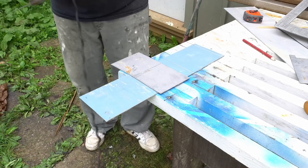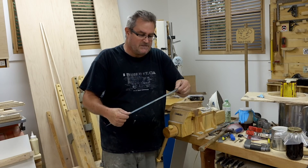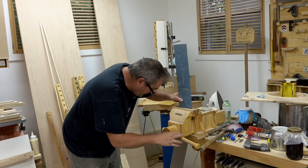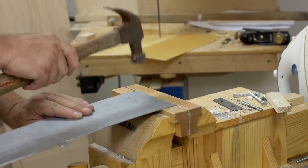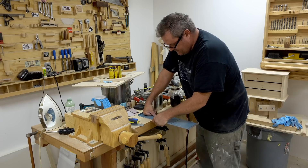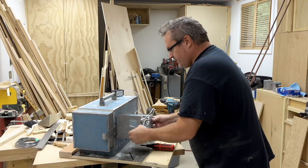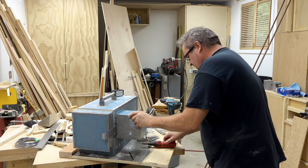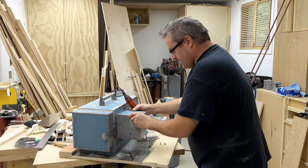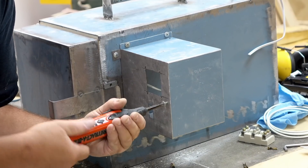This long piece needs to be bent into a U-shape with tabs on the end to fasten it onto the side of the case. To make it bend easier, I cut score marks right along where I need to bend it. I'm going to use my vise and the edge of my bench to make these bends. For the main bends, I can do that just holding it by hand — line it up at the edge, bend it over, and finish the bend. I've already drilled holes here for the screws. I'll get it all put together first, then take it apart to put the equipment in, just to make sure everything is done correctly.